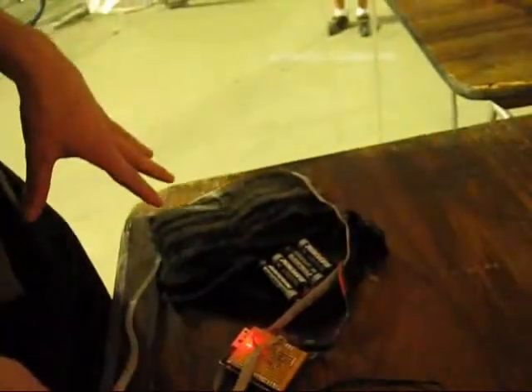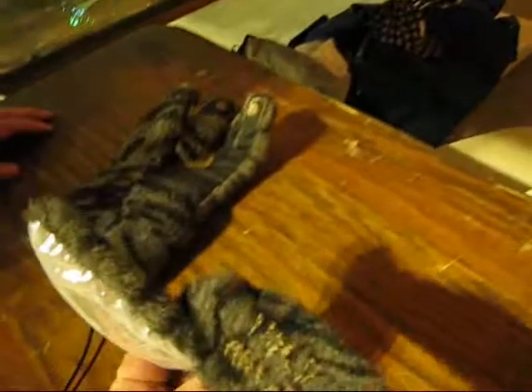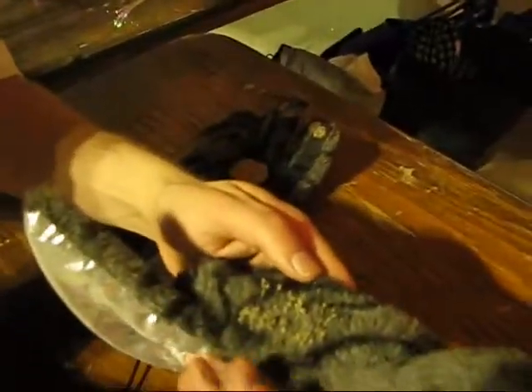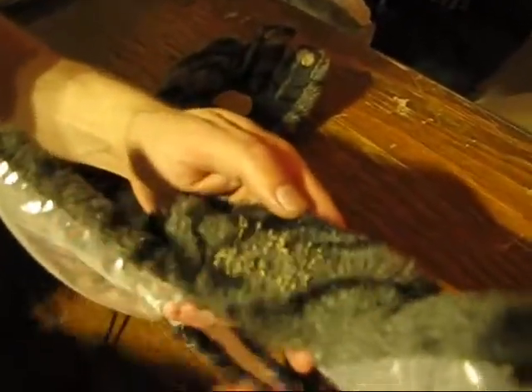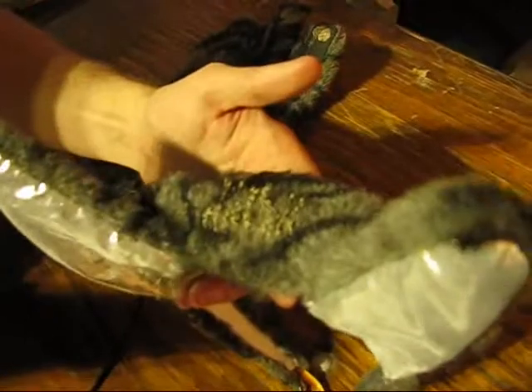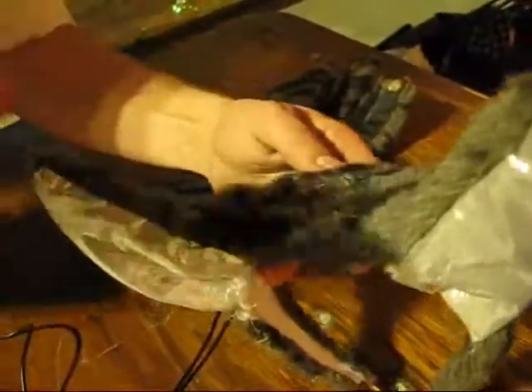This belt was around my leg, and when I put the rest of my outfit on, it hit all the wires — which amused and surprised some people. There are two rows of conductive thread coming up through the fur. You have to push the first row back so that it hits the second row, and when the fur springs forward, it opens the connection again. You have to go with the grain of the fur — you can get it to work going the other way, but not as reliably.